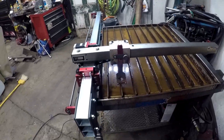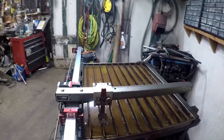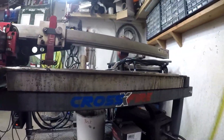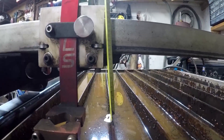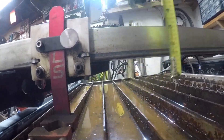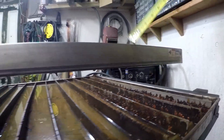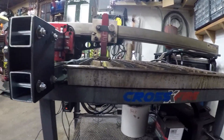Something you have to look into when you do this is that since you are unbolting your head tubes, your gantry might come out of alignment. I was anticipating this and it was a true thing. I'm glad I checked it before I started trying to cut stuff. Over here we've got roughly three and five-eighths from the boom to the slats, and on the other side we've got roughly three and three-eighths. So there's roughly a quarter-inch difference from one end to the other — we need to true that up.